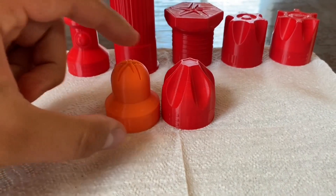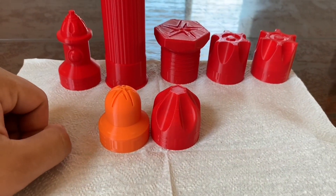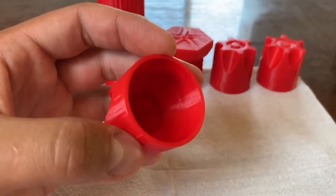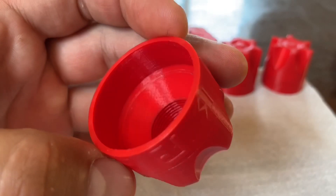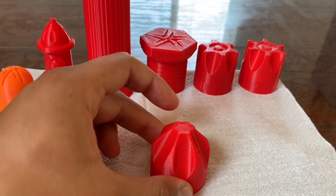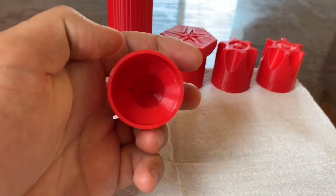But just as a reference point, look how tall this is — it's the same height. So it's using barely any material. It has some cutouts in there, and at the same time everything on the inside is 100% infill, all 45-degree angles. So I printed it just like this on my last bed, and this is all I was holding on and it holds on just fine.